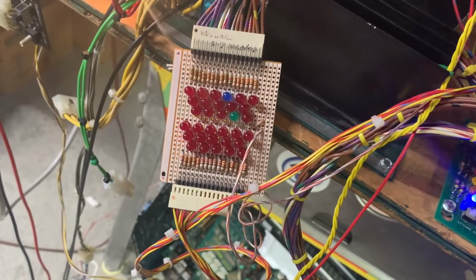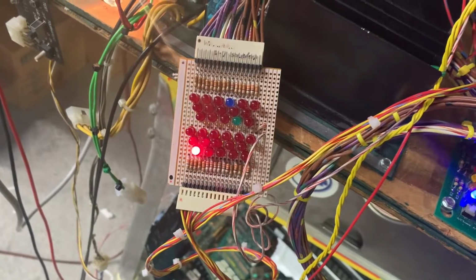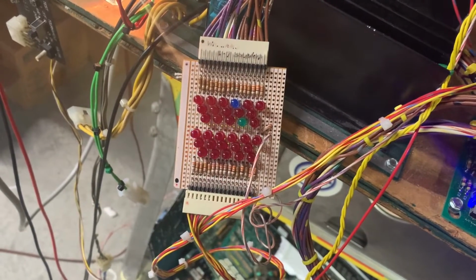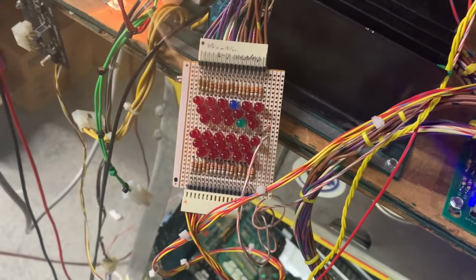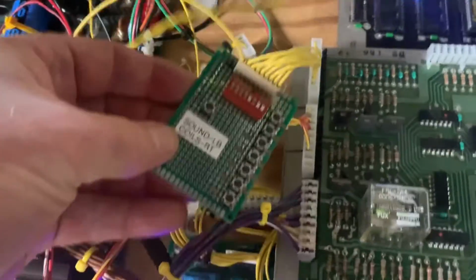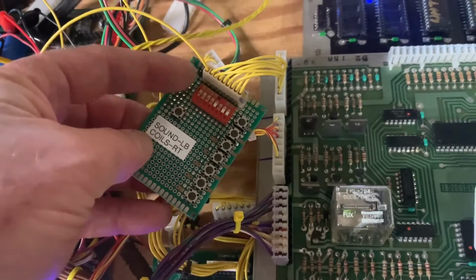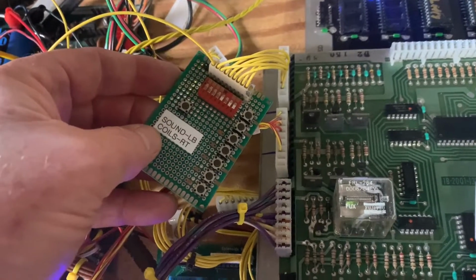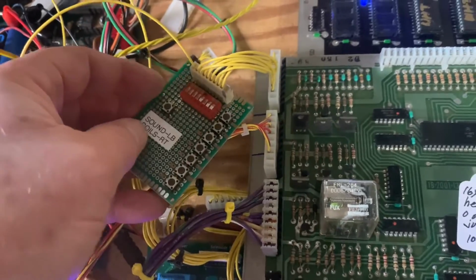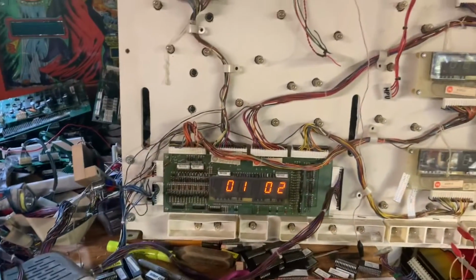Now I'm going to close the switches for the special solenoids one at a time. I'll show you this little jig that I built for that, and there are 6 of them. So this is the little tester doodad. It's multi-purpose. It closes switch solenoids on a driver board, and it closes the sound selects on a sound board. Kind of nice. So next test is switch test.